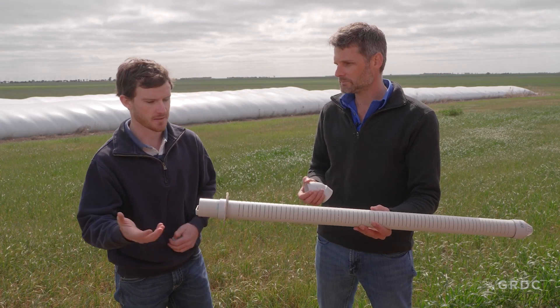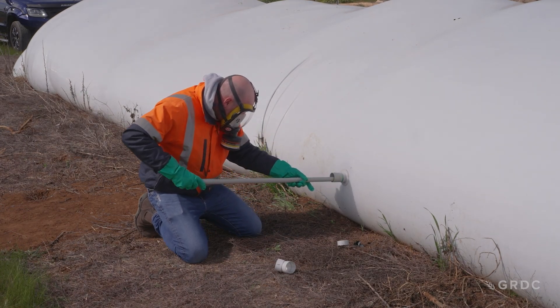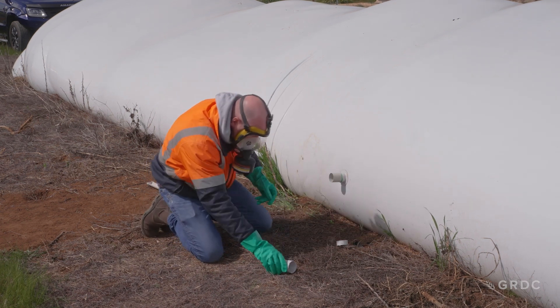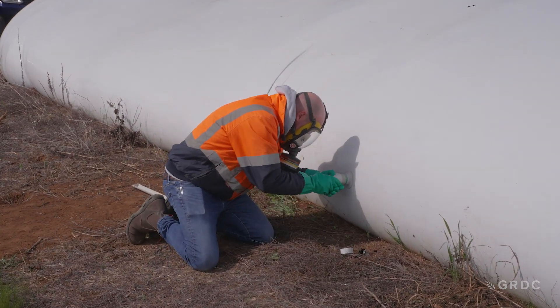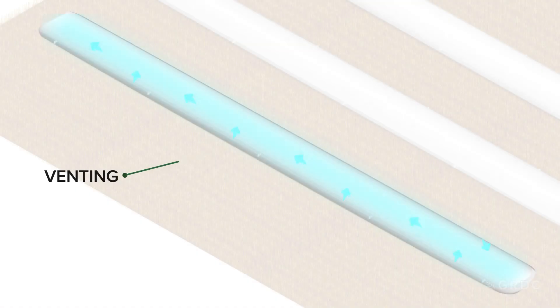To go about venting, we have to remove our residual phosphine. We can put a 45-degree elbow to try and keep the weather out of our passive tube. It actually allows air to travel in and out of the bag and that gas to passively vent. The trick is that we know it can take a considerable amount of time in a bag — venting can take quite a while, up to 35 days in the trials that we've done.